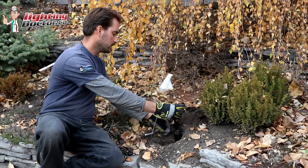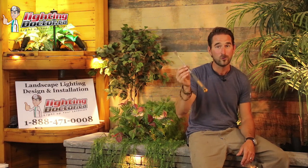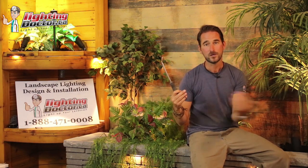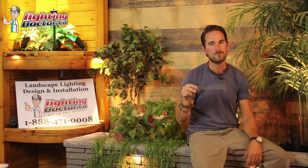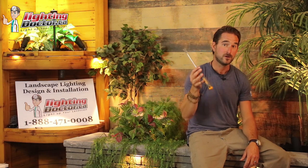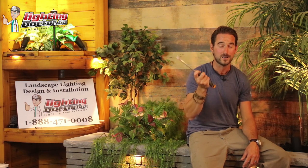Once you've got that in, you can simply screw your light in, then come back afterwards, make your connections and bury everything. I don't even really know what this is called, but you can get it at any home improvement store in the garden aisle. It's basically a long metal stick with two prongs on the end — great for pushing the wire a little bit deeper in the ground. As you make your slits in the ground to get that wire in, you can use this two-pronged wire poker to push the wire deeper so it doesn't come up. If you know what it's called, please email me with the details!